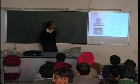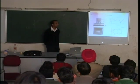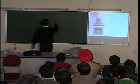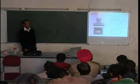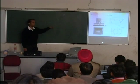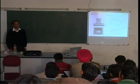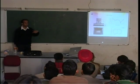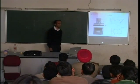When I say S11 should be very small, then only I can say the antenna is working well. How small is very small? The worldwide convention is 0.1 is small. Not S11, 0.1. S11, minus 10 dB is small. Minus 20 dB is even smaller, which is good. S11 equal to minus 10 dB means 1/10 of the power, 10%, is coming back, which means 90% is going as radiation. That has been taken as a benchmark, accepted as a good benchmark for a useful antenna.